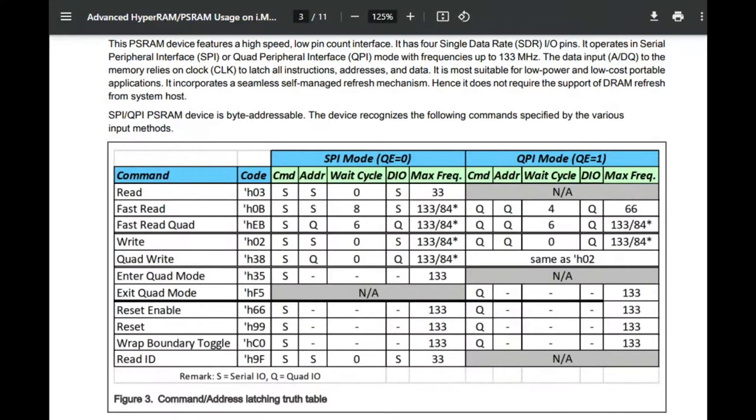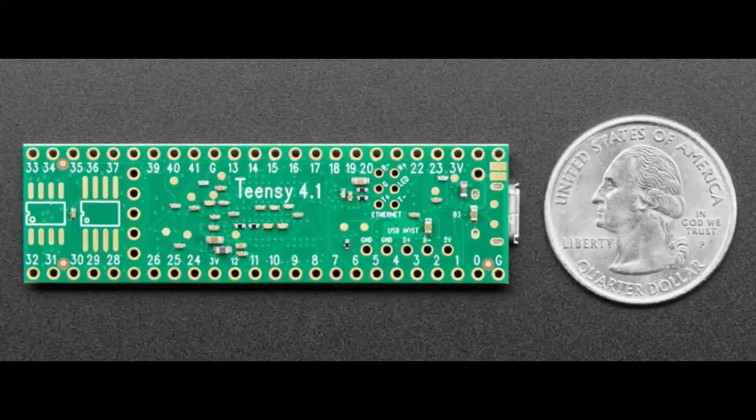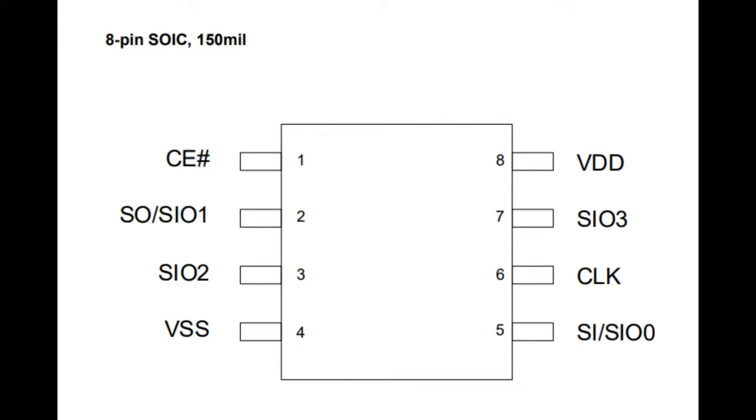More chips like the ESP32 and also the IMX series support PSRAM. There's a datasheet where you tell the chip that these six pins are connected to external QSPI RAM, and it reads it on boot and integrates it into the program so the program sees it as a continuous chunk of memory. It's slower than onboard SRAM, but for example on a Teensy 4.1, you can buffer a gigantic waveform for a synth project — maybe 32-bit resolution — and you'll need a megabyte of PSRAM. You can solder it on the bottom; there are two spots, one for flash and one for PSRAM if internal SRAM isn't enough.